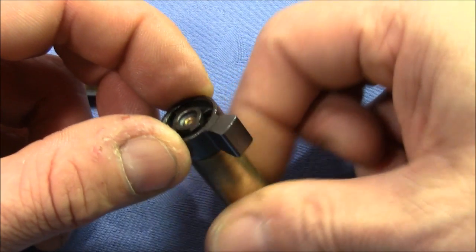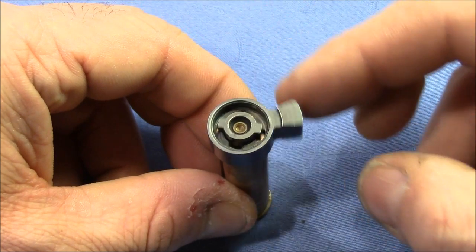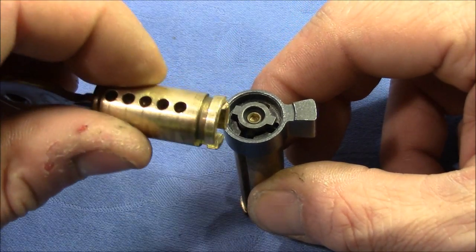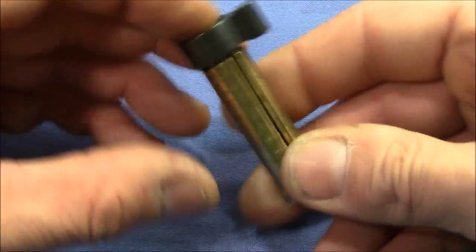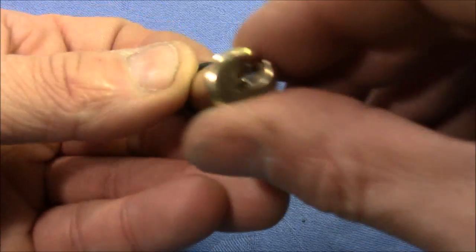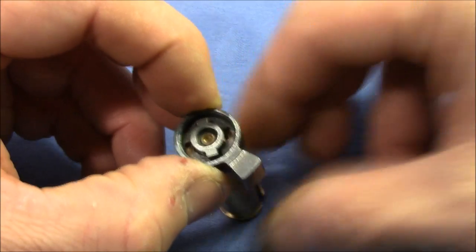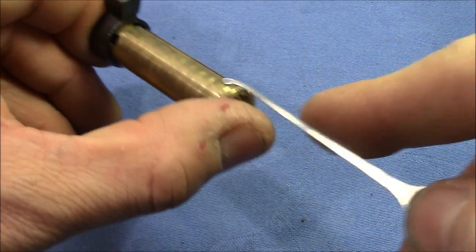Cam and right side, the picked side, are not interacting, and the cam is interacting with this actuator, and the left plug would turn the cam. So now how can you operate the cam from this side? If you stick something in which goes inside the keyway, and there is a little slot here you can see, if you manage to reach one of these cutouts in the cam, then you can turn the cam. So let's try that.